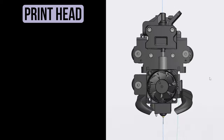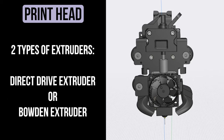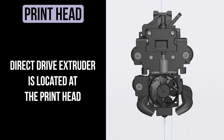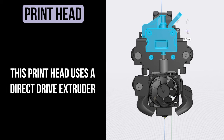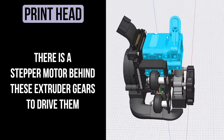We need the filament to cool once printed in place so it will stay where it was printed. So now we're getting filament out of the printhead and onto our model, but how are we feeding the filament into that system in the first place? This component is the extruder or filament feeder. There are two types of extruder methods commonly used today: a direct drive extruder or a Bowden extruder. Both options move filament forward at a very specific defined rate from the spool to the nozzle, just in different ways. With a direct drive extruder approach, which I prefer, the extruder gears and motor are located at the printhead itself so that it only needs to move the filament a very short distance before being extruded out the nozzle.